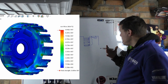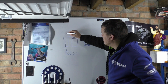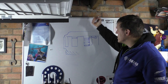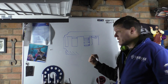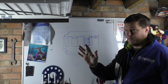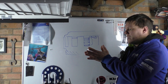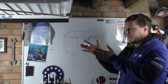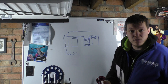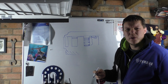Basically it's two reasons. Number one is they found that when your pressure plate starts to engage, it's usually this shape where your springs are forcing it down towards your clutch pack. This last outer plate is the first one that engages your pressure plate. They don't all evenly concertina in and out — it's shove, shove, shove. So the first one to grip is the one closest to your pressure plate, and it helps with chatter and noise in clutches.